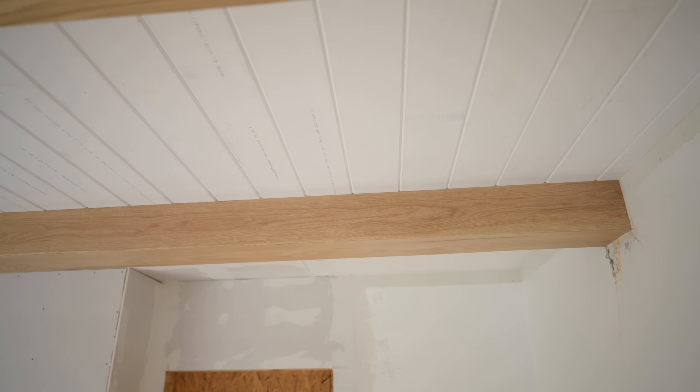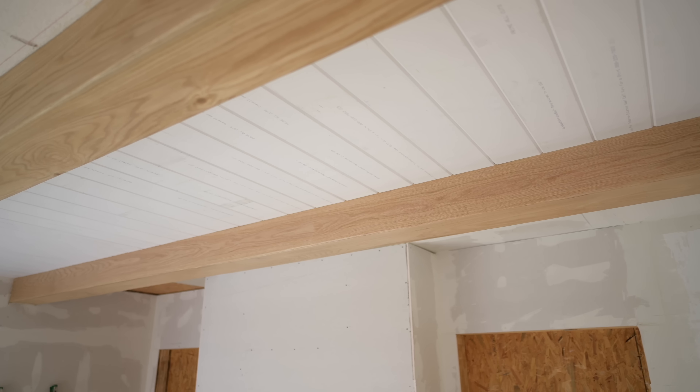This is another tedious thing — if you want to talk about endurance in carpentry and painting. When we mask off, we can run a straight tape line across the tongue and groove profile, but when we get to the V-match at the beam, we're going to have to rip two pieces of tape to make that 90-degree corner right there. That's crazy, and we're going to do that. I'll probably spend one of my weekends just doing that.